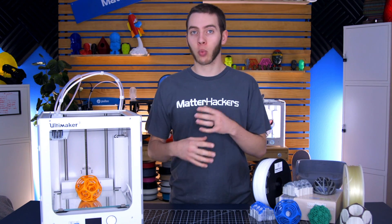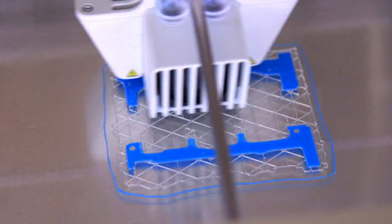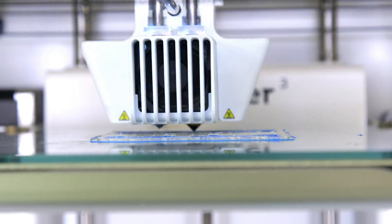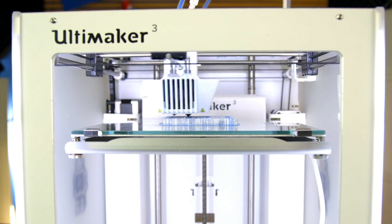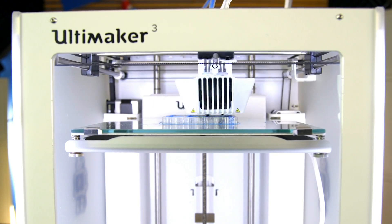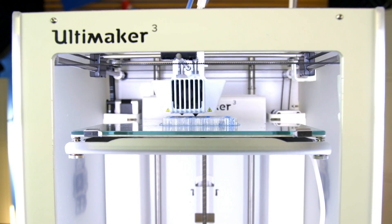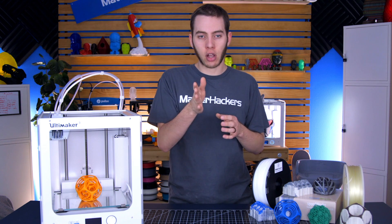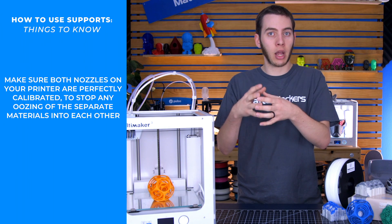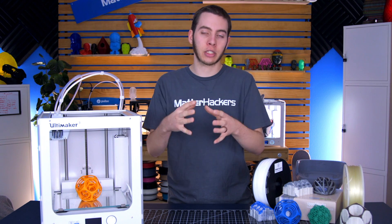You really want to make sure that no matter what material you're using, your printer is really well calibrated. Whether you have two nozzles directly side by side, an alternating system, or one nozzle where filament purges and the other filament comes in — make sure it's well calibrated. What you don't want is support material creeping into your part, because when you dissolve it, you'll just have voids. Make sure that when the left nozzle is at zero-zero and you switch to the right nozzle, those line up pretty well, because any variation will show up as support that's leaning into your part.